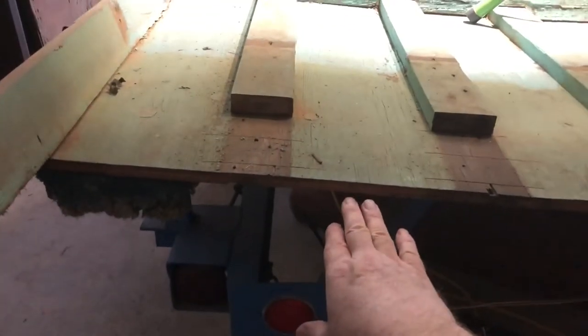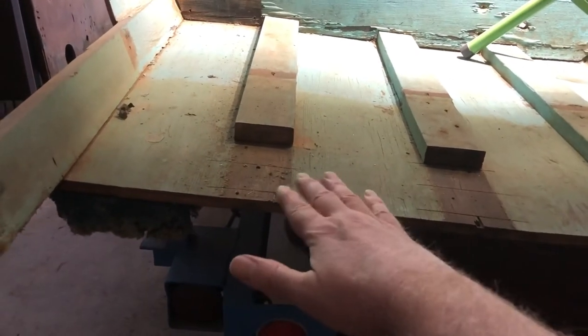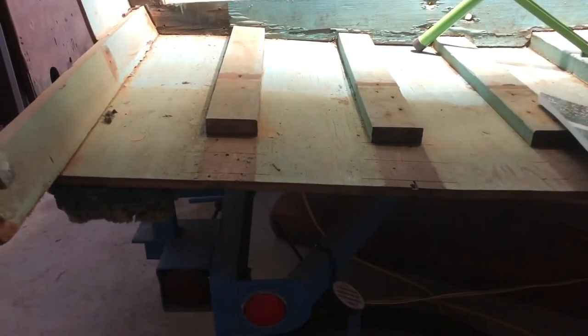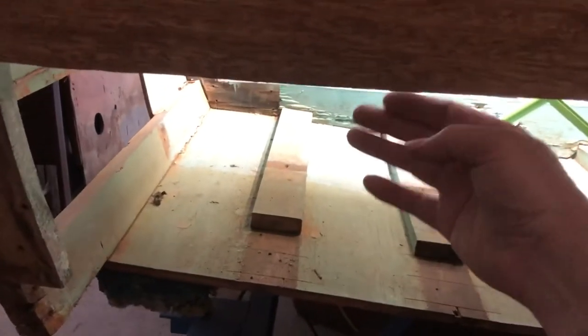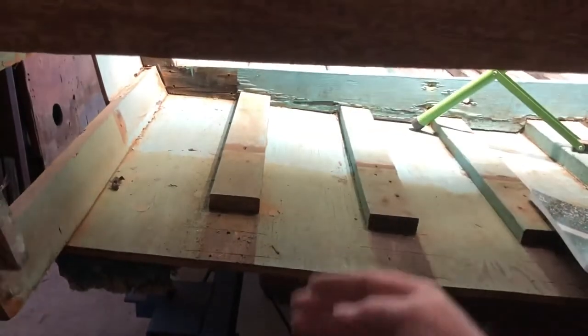You butt the new plywood up against the existing bottom, then put a bigger piece of plywood over the top, so you have a backed butt joint with thick plywood. Then on the transom, do the same — have a new piece of plywood to replace the damaged area, and then from the inside I'll lay a whole new transom plywood against it. So it'll be stronger than it was new. That's not too difficult.